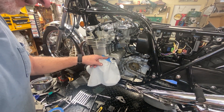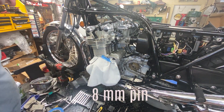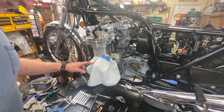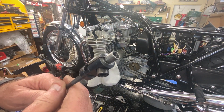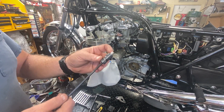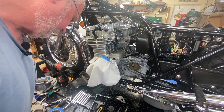Because it's a recessed hole, that's the problem. There's a guide pin - knock pin - that goes in here. It's one of the two pins that lines up the stator cover so the stator doesn't hit the rotor from misalignment. Here's that pin still in the puller. So that is a recessed thread, recessed about that far.